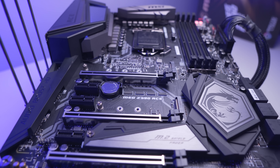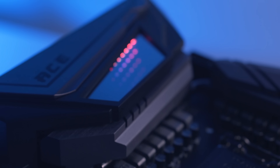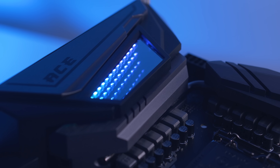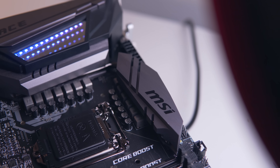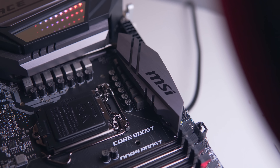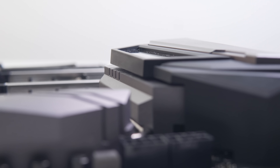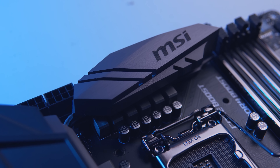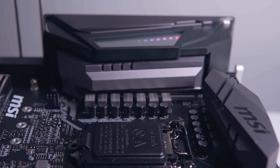MSI's branding refresh here is aesthetically quite nice, with an overall neutral design and RGB illumination reserved for just the IO shroud. Rather than diffused RGB elements positioned randomly, they've gone with an infinity mirror with RGB lighting, which looks pretty cool. The RGB shroud does cover a decent portion of the VRM heatsink though, which prevents heat dissipation in that area. The heatsink itself is also somewhat void of any true heatsink fin design, which seems to be the trend these days.